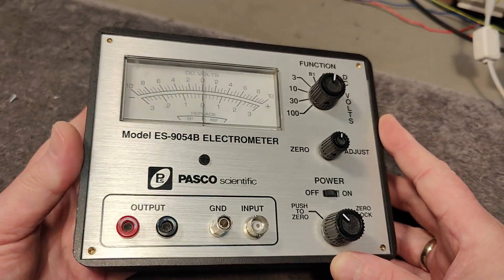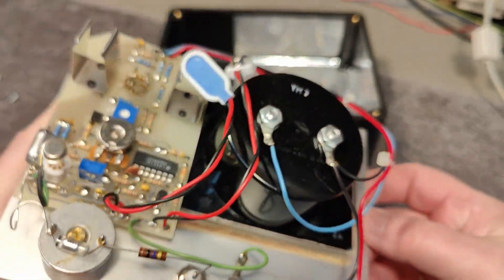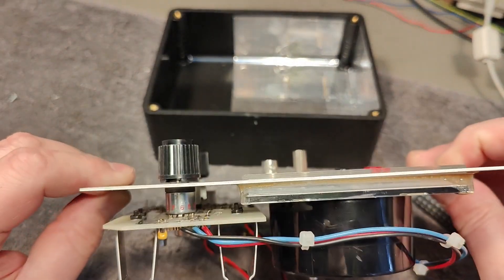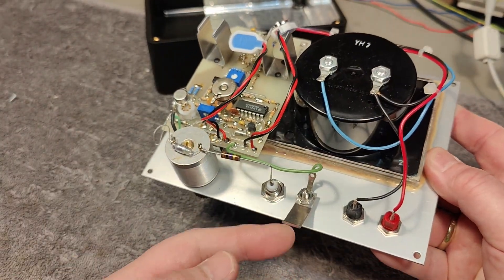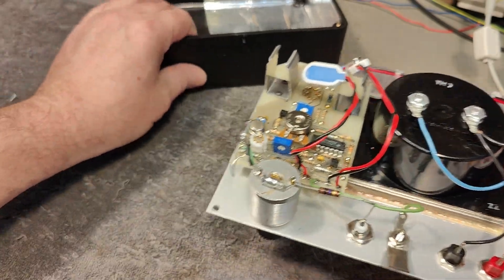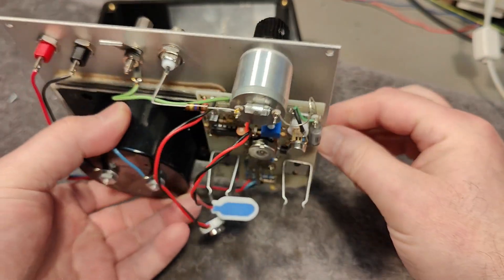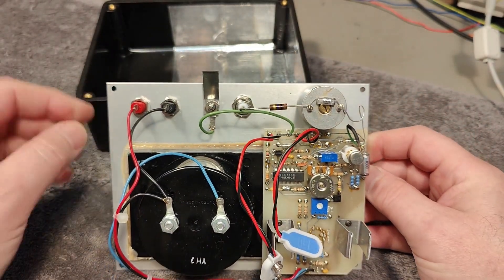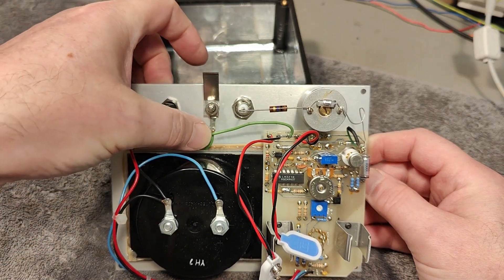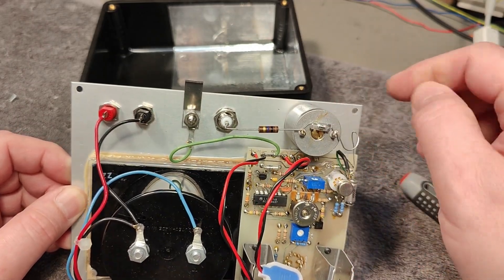They don't even say it's working or anything like that. I got a little corrosion marks here from batteries. We put in two 9-volt batteries. The chassis — or this is just the front plate — is of course electrically connected to the shield. This is where we have the input, the circuit board, and all that. So here is our 100-megaohm resistor. I bet this wire is not supposed to be touching the input. And then this really special switch, and there's even a little capacitor.